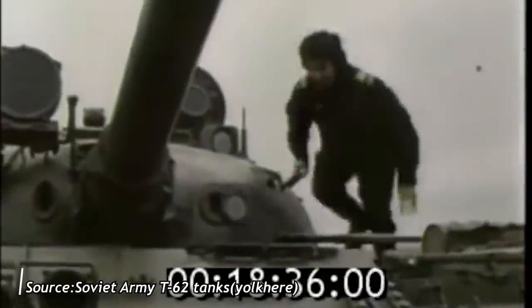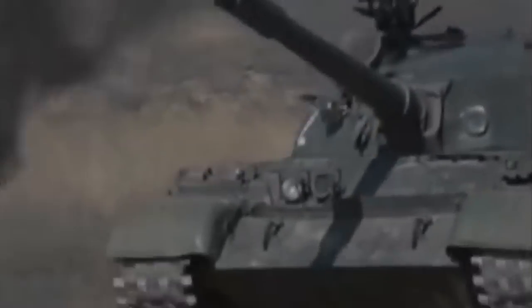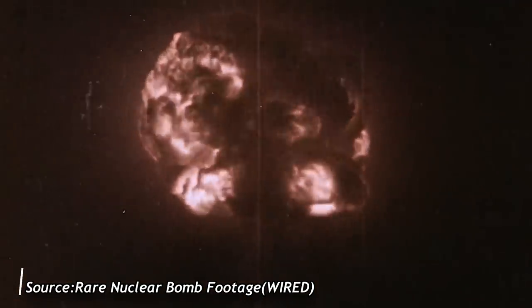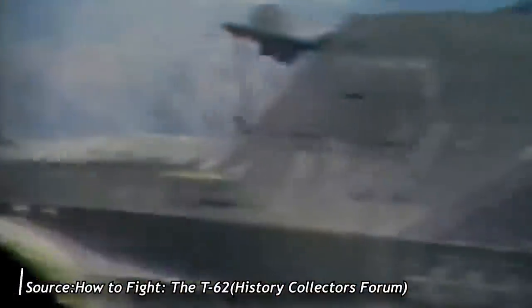The highlight was really the turret. Domed turrets were very much in vogue during the 1950s, and for the T-62 the choice of a well-rounded turret was motivated by many of the same design reasons. The rounded walls on domed turrets gave excellent ballistic protection for their weight and were also beneficial in terms of withstanding blast waves — particularly nuclear blasts — since the shape made it harder for blast pressure pushing on the turret to damage the turret ring.